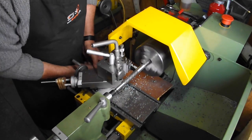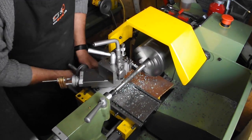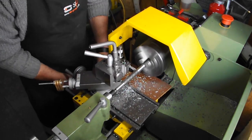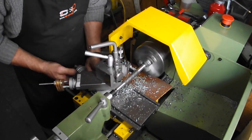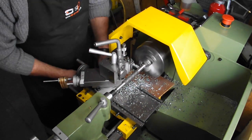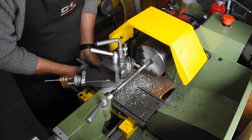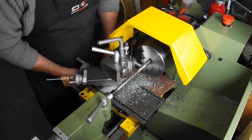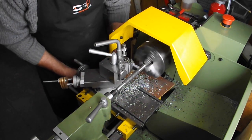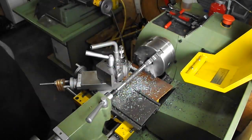Now I've moved the material out enough to put a recess in the middle of the spindle's major diameter. I'm using a 10mm button tool to provide the two 5mm radiuses at each end of the recess. This is blending the smaller 11mm diameter to the larger, as yet unmachined journals. This recess will be roughed out and finished all in one go, as this is a grease pocket and there aren't any limits to work to.